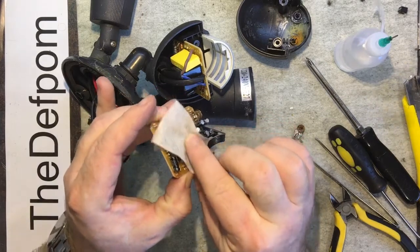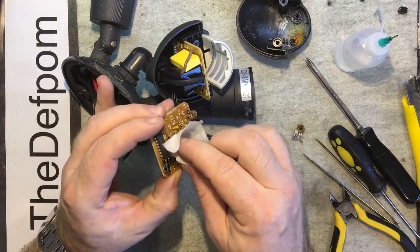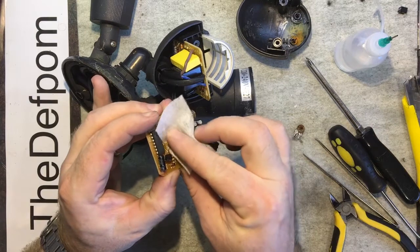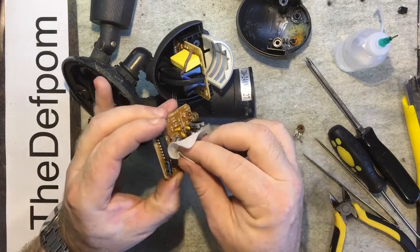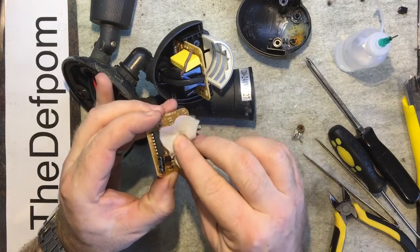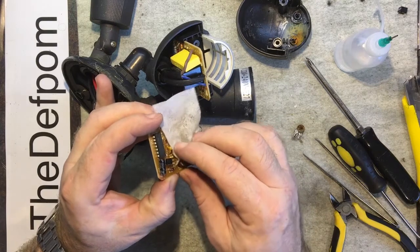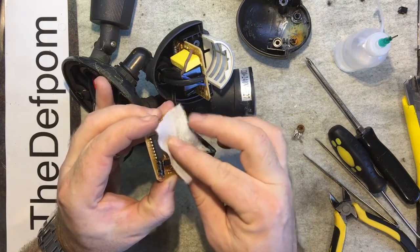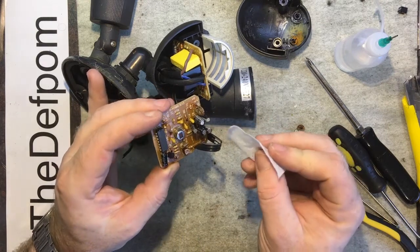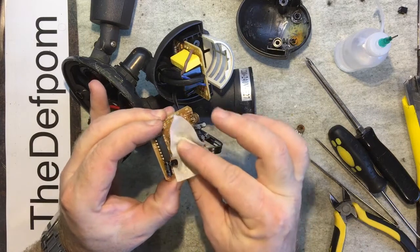Can't help, can it? Well, can't harm it, rather. It could help. Still some crap on that sensor. Who knows? Might be a combination of factors. But I might check all the capacitors too before I put it back together, just to be sure they're all okay. There's no signs of any other corrosion on there apart from that one trimmer. So I have to see if that's the issue or not.